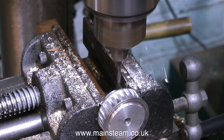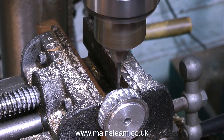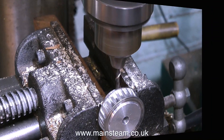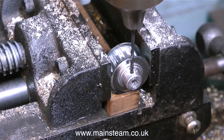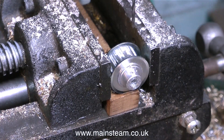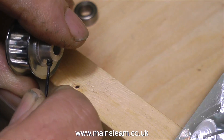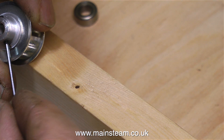This is but one of the functions of a wiggler or wobbler, and I'll be showing other applications in future videos. I'm drilling the one-eighth of an inch diameter hole, and now I'm drilling the other pulley. There's a slight difference with this one — once I've drilled through one side of the pulley, I'm drilling through the other side from the inside as well. And once I've threaded this 6BA — because it's a much smaller pulley — I can put a 6BA grub screw in each side.